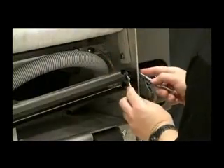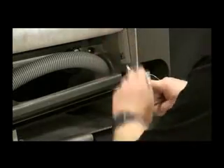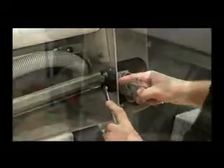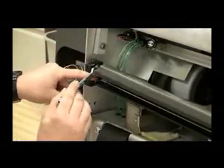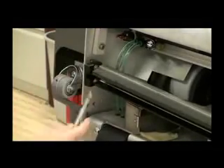If the squeegee has uneven contact due to topography issues like crowns, you can adjust for it also. Loosen the two mounting screws on the 7-pin side with a 3/8-inch wrench. Position the blocks towards the center frame to decrease the squeegee contact in the center of the assembly, then tighten the two mounting screws. Loosen the two mounting screws on the 10-pin side and position the block the same as the 7-pin side. Tighten the two mounting screws. This will help improve cleaning when there are large crowns in the lane surface.